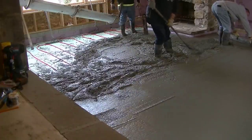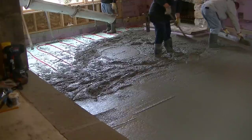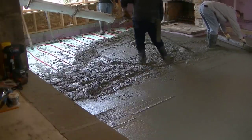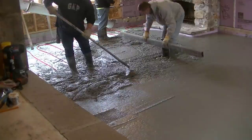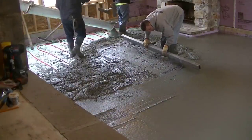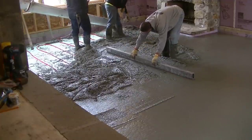That's the rest of the room — you can see we're going around a little fireplace there. We've got some expansion board up against the fireplace and styrofoam up against the outside perimeter, kind of to act as a thermal break so you don't lose any heat out the edges. This room ought to heat really, really well when it's all done.